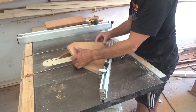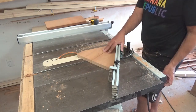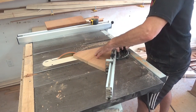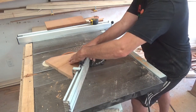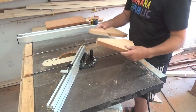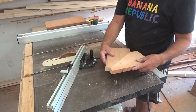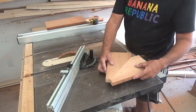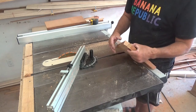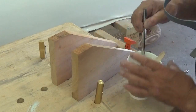The question is, did I contact the whole piece? I think I need to just shave a tad bit more. And there we have a beautiful joint with a bit of a peak in the center, so I can glue these together for installation at a later date. After doing a little dry run of a clamp up, I'm just going to put some epoxy on both these surfaces.